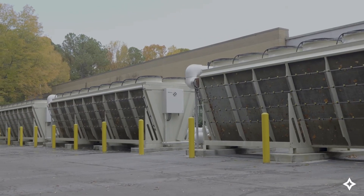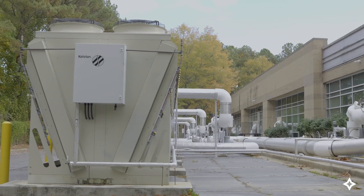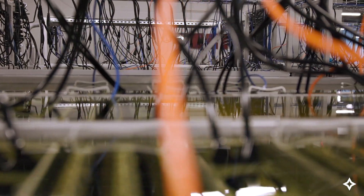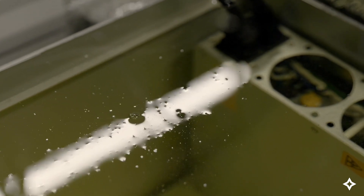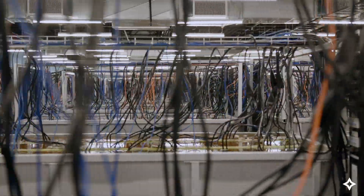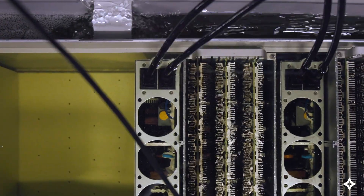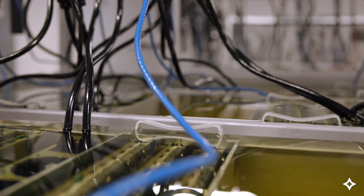The water therefore runs out to a dry cooler expelling the heat into the atmosphere. The cooling process takes place in a large dry cooler on the mining campus. This allows CleanSpark to use less oil and remove the heat at the tank level. The oil maintains an even temperature of around 104 degrees Fahrenheit while protecting the machines from dust and temperature fluctuations. Depending on the environment, the liquid has a usable life of five to seven years.